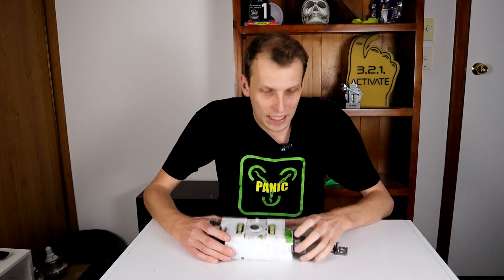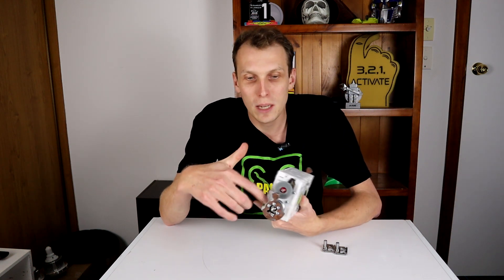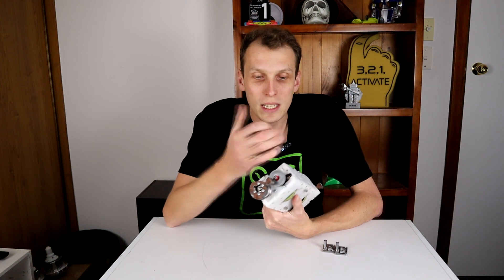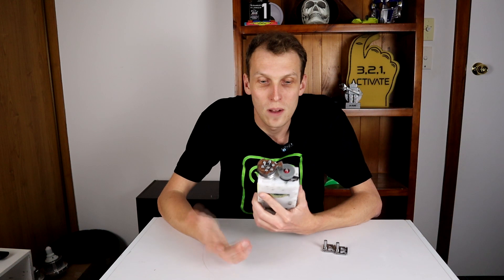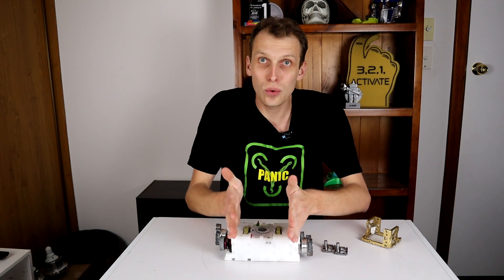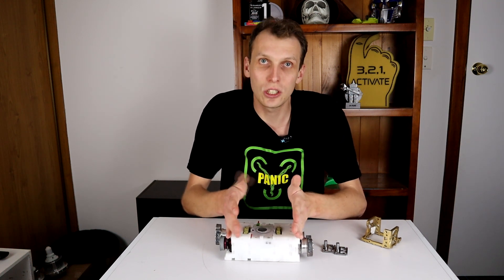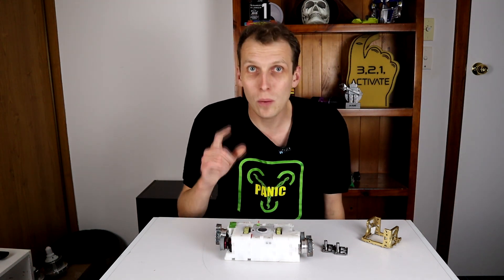The weapons themselves were also a problem. The 6mm HDPE plate at the front was warping and bending, stopping the belt from being the correct distance, meaning the belt got lost every single fight — including the one right before now, because I have no belts on here right now; they came off in a fight. This has shown that all I need is metal at the edges to fix this issue, so we're bringing back something that didn't work in the past but might work for us here.